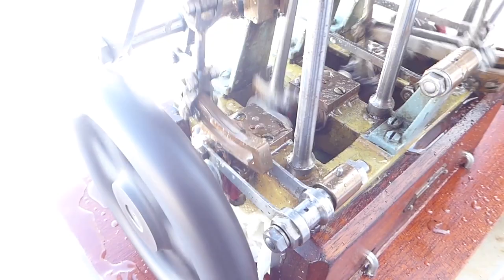On the low pressure cylinder there is a Fink valve gear. This gear was used on Porter Allen engines from full to mid travel, but this one goes all the way over for a reverse because it's a marine engine. The Fink valve gear features a rocking expansion link mounted on the eccentric, and the reverse is done with a radius rod like this.